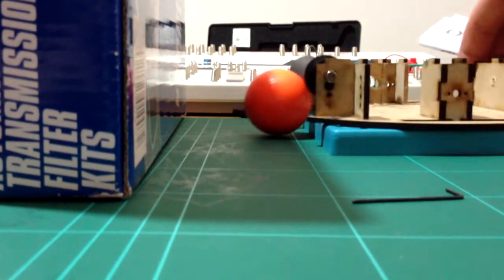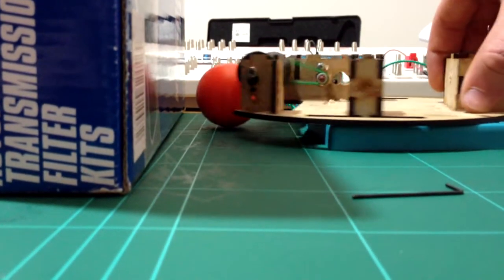Driven by two 30:1 ratio micro-metal gear motors, the differential system is powered by a 7.2 volt dual-cell lithium-ion battery, providing sufficient power for the electrical systems. The nominated dribbling system comprises a 3D printed cylindrical bar coated in a soft PVC material with silicon bands to provide a cushioned yet high friction tread. Optimal height positioning provides maximum applied normal force capable of grabbing the ball without compromising the 20% ball coverage rule.